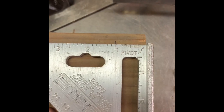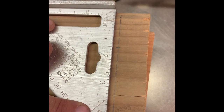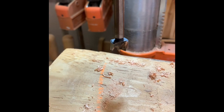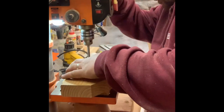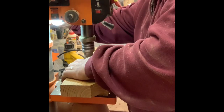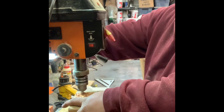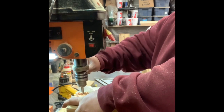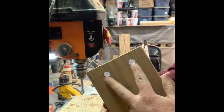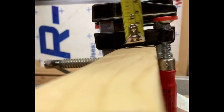Marking in one inch from the end, scribing a line down the back. I'm making a mark at inch-and-a-half and four inches for the screw dowels. This is a five-eighths inch dowel — I have a five-eighths inch Forstner bit on there. Two dowel plugs. Next we need to measure the height.